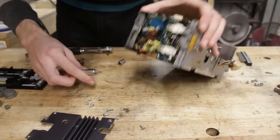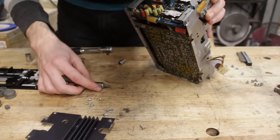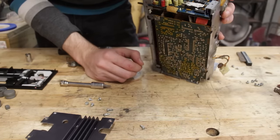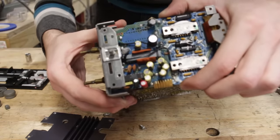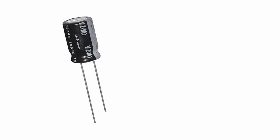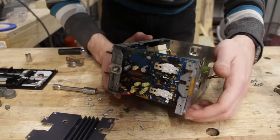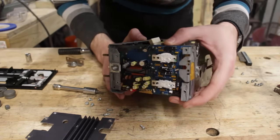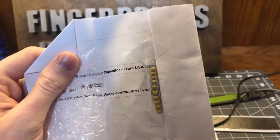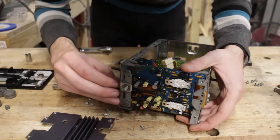Those don't apply to me whatsoever. Those three electrolytic capacitors that fail, fail because they are undersized. They have to be very short in order to fit underneath the heatsink for the chips on the amplifier board. These guys right here, as you can see in David's video. But they're not there on mine. My whole board not only has all the components in different locations, but it already makes use of ceramic capacitors. Replacing the electrolytic capacitors with the new ceramic ones is what you do to fix the noise problem, but it looks like Delco already figured that out by the time my board was manufactured. So, besides $2.45 going down the drain — because I jumped the gun and bought the replacement capacitors before I even removed the radio from the car — I now also have no idea what the problem could be. The only thing I can really do is just keep looking, I guess.